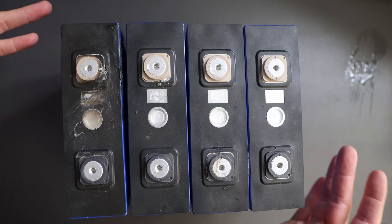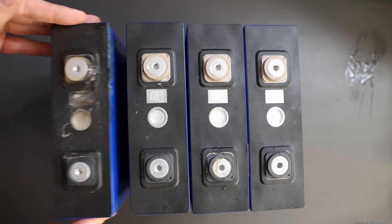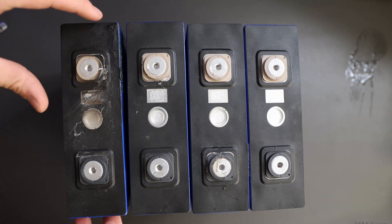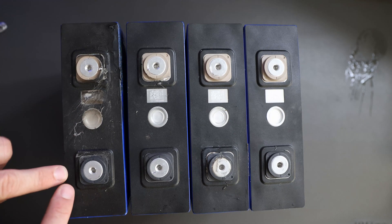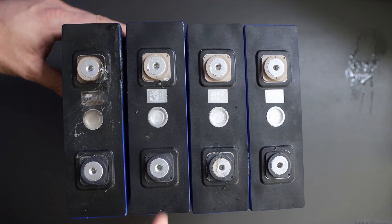This cell which I unpacked — this one is pretty good. But three out of four cells in one package had issues. And I'll show you what I mean. Those are the four cells I received in the shipment. From looking down you would say maybe three out of four are okay — but since you buy a package of four, it's not okay, because one is not working. So you don't have a 12 volt battery. Look at the condition: when you look at this cell here, the terminals are completely worn off. It's damaged. It looks like it had some fire issue. The QR code is not readable. The vent is not good. It's just all over damaged. And on top, this one is already having some bulging. You can see a big gap, and I'm pushing them against this one which is also bulging. This one has a lot of bulging. This is a cell to throw away immediately — don't even look at it, because if this is happening to a terminal, you don't want to mess with that.